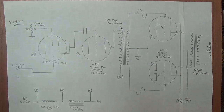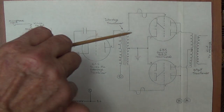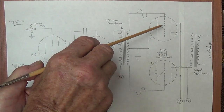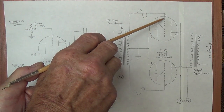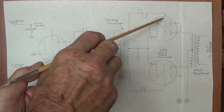It's just upside down. Now, exactly how this works is rather complex, and I do not want to let it distract us from the idea of the signal flow through this amp circuit and the difference between it and the first mystery amp. But I will go through this very briefly. Imagine you send your signal in here to the grid, and this triode acts like any other triode. The electrons flow from the cathode to the plate, moderated by the signal on the grid. We know that the signal is greatly amplified by this process.